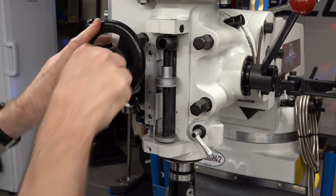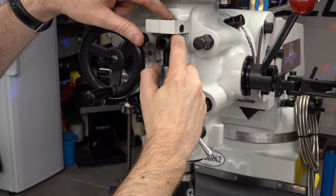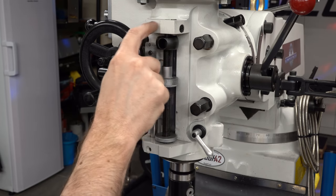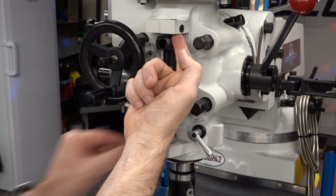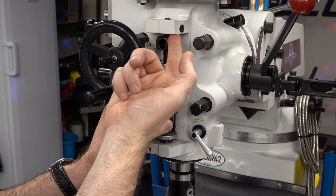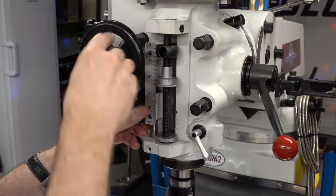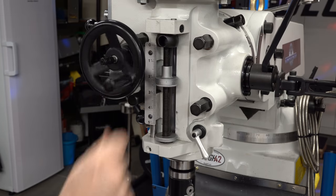If you're feeding upward, there is also a stop at the top. If you look up underneath here, there is a tiny little button and a cylinder that moves up and down. Inside the casting there's a tiny barbell-shaped lever, so when the stop comes up and hits this lever and forces it up, that forces the screw down. You get the same effect — it hits the top, that lever forces the screw down, which through this lever causes this to trip. So you get exactly the same automatic disengagement in the upward direction.